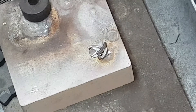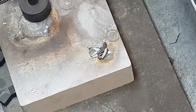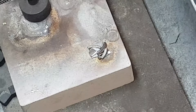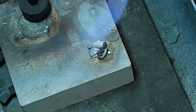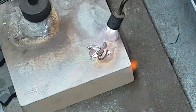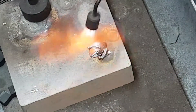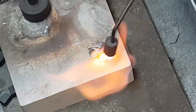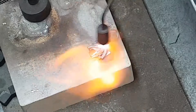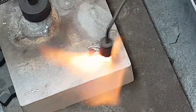I melt into a blob. Trying to melt into a bar form with platinum, or tipping it into a steel ingot or even a ceramic ingot — it's just too hot. It just cracks. So I'll use this way, and I've found a lot of success ever since I started doing it this way.